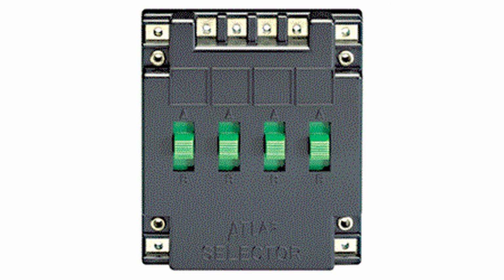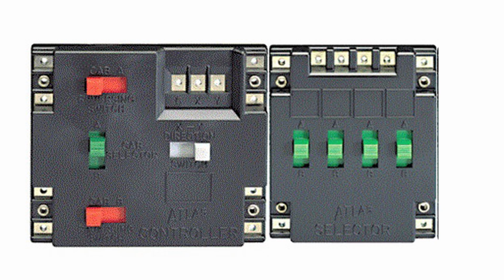And this simply attaches to the end of the selector. They butt right up against each other, and then they sell a little spade lug that will tie them electrically together. You'll notice it only ties one of the two terminals because the other one is the common rail. So these 4 terminals now run off to the isolated rail, the single rail in each of the 4 blocks that you want to control. The other rail, of course, still being connected through the common rail.